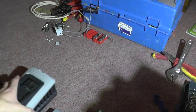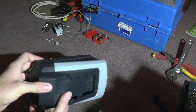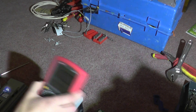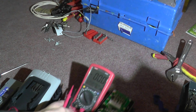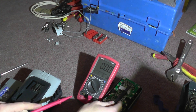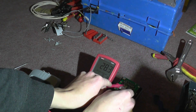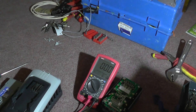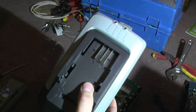So if I set the meter up: that pin that we're missing is the negative. If we have positive on here and negative on there, we're showing 28 volts. So no, we can't use that. Because if we go to the real negative, we're showing 41 volts. I don't really want to backfeed or go through the electronics, because I might fry it. So the problem is the charger needs that fourth pin.